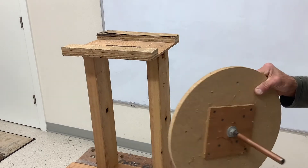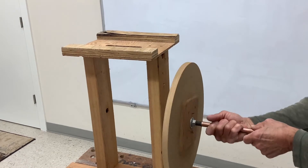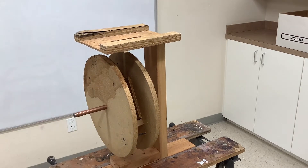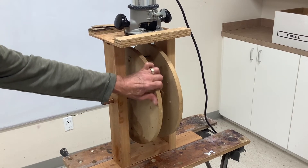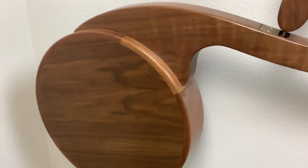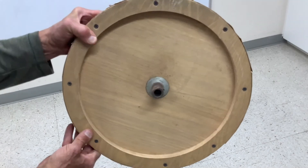Two three-quarter inch plywood discs were cut to tightly fit into the holes cut in the octagon side. A long axle passed through the center of these discs. One end of the axle was a one-half inch by 13 threaded rod about 6 inches long; the other end was a smooth one-half inch rod about 10 inches long. These discs were held in place by wood screws that went through one disc and screwed into the other. This assembly of the octagon, discs, and axle fit into the jig. The router was adjusted so the end of the cutting bit was 8 inches from the center axis. This assembly moved one-thirteenth inch per rotation along its axis, which fed the octagon into the router bit. The joint between the weight wheel and the expanded end of a pendulum bar needed to be tight for both strength and appearance. I made a 16-inch drum sander for my multi-function shop tool to quickly make this joint, using the wheel jig so it exactly matched the weight wheels.